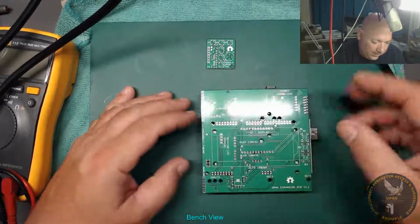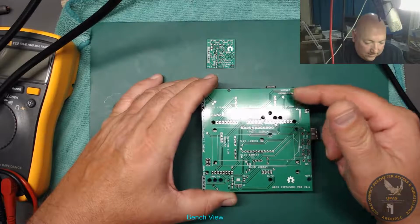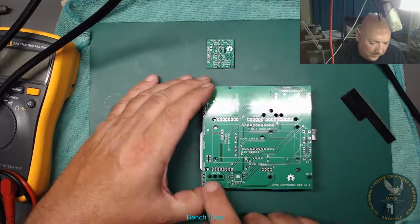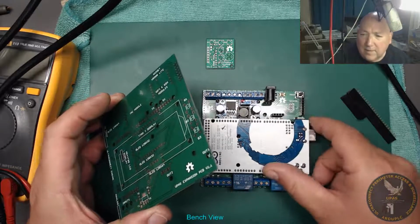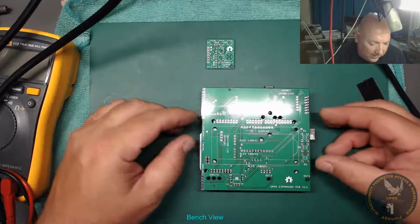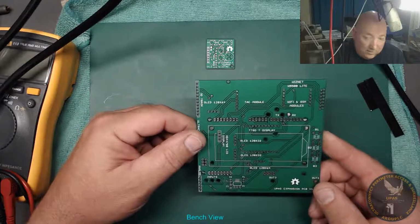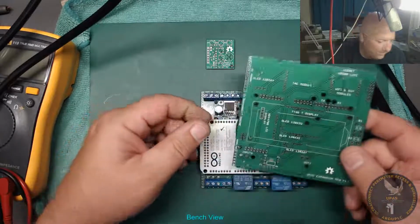This one slots on top of there, and it gives you push buttons, displays of various types, a WIZnet W5500 Lite Ethernet controller. It's more of a holder really. You've got some holes here, so the LEDs are down in there. You've got 3 LEDs, one there, and 2 up the top. If I put this board on top, I'm going to block out all the LEDs. So I've used the bottom as a template, and I bought some 3mm acrylic rod, which I've got to cut and polish the ends off. I've already tried it, and they do work, even though they weren't specifically bought as light pipes, and they do bring the LED light up. So that's basically what I wanted to do.